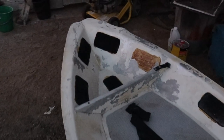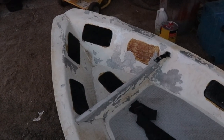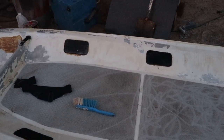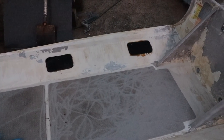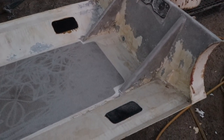We're getting up first thing in the morning so that we can put the paint stripper on. We're doing it while it's as cold as we can get it, and then we're going to wrap it up so that it's in the shade. We're also going to wrap it so that the gas and the chemicals in this paint stripper get stuck in that little cocoon and stay working on the aluminium longer, basically.